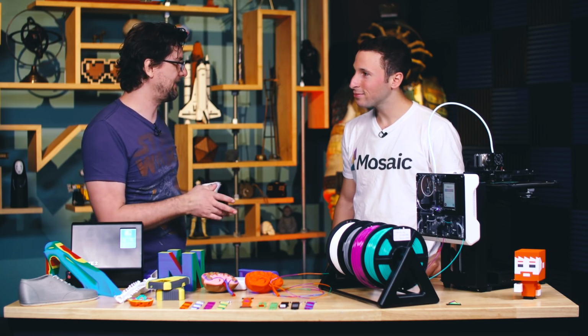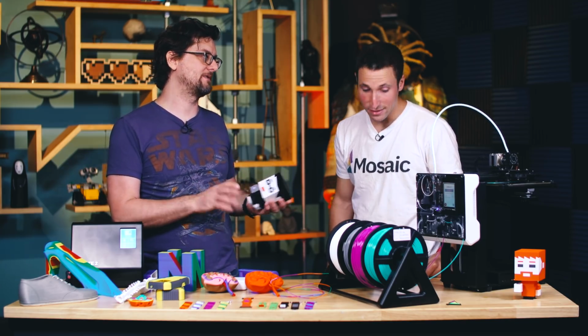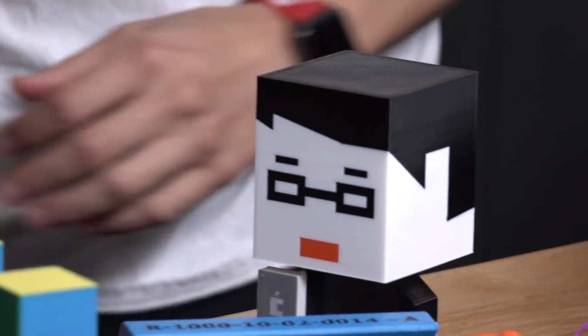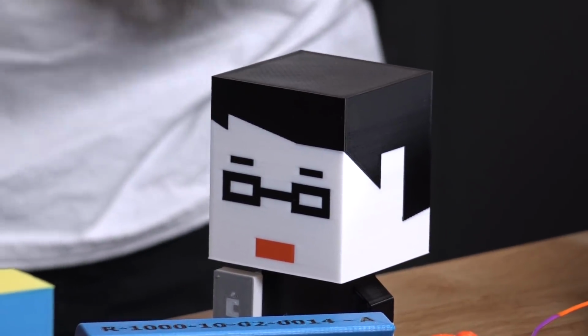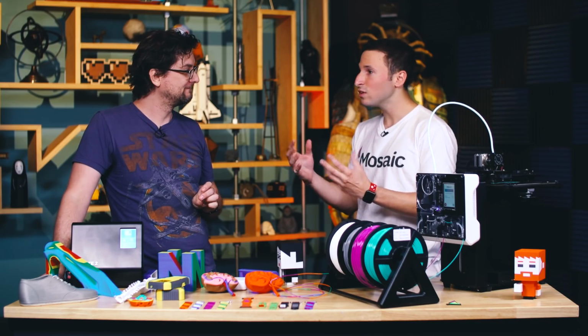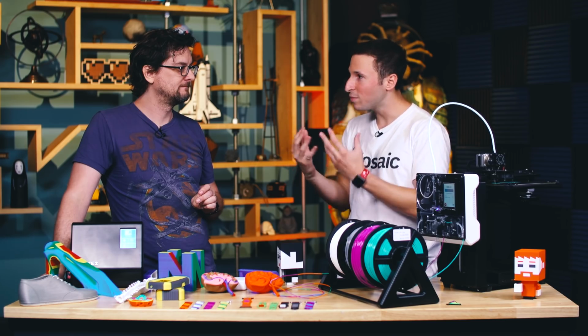So how are you dealing with wiping things? Do you have a tower or a purge wall, or what are you guys doing? Yes. So in Canvas, we will create what we call a transition tower. But before I even get there, something that I might have skipped over before, something you wouldn't be used to, because we're doing it using a single nozzle: those boogers or the ooze, there's no such thing. You're always printing, so there's no idle nozzle dripping through material.